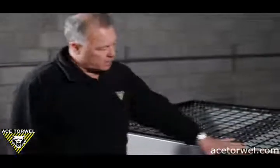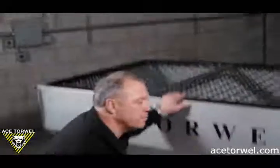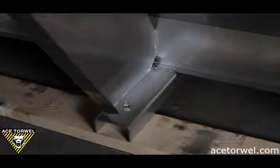Each side is formed from a single sheet of stainless steel, in this case 304, and formed with a 45-degree angle to allow free flow of the material to the chain, supported by a minimum of 3 gussets welded to the hopper body and to form base channels.